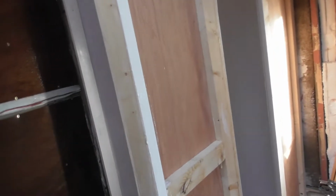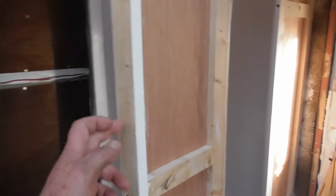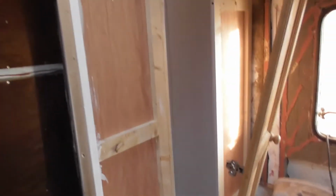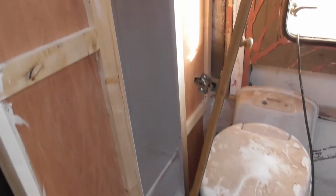Then I can sand that wall down, put the wallpaper on, and then make some trims with wallpaper. Bearing in mind, we are putting a block of wood on there, but I don't know how much wood is going to be showing. You know, this pine, I don't know how much will be showing, so I think if I put a plywood batten down there first with the wallpaper on, then the oak on top, it will sit at the same level as the outer one is going to be all the way around, and we've got to sand that all back as yet. There's just no point at the moment.